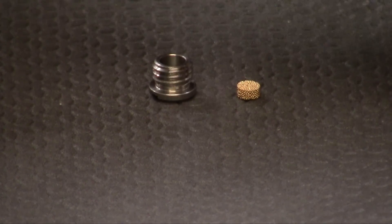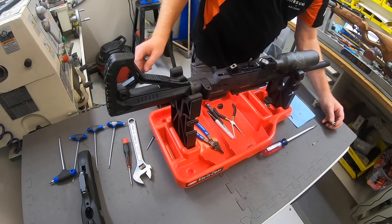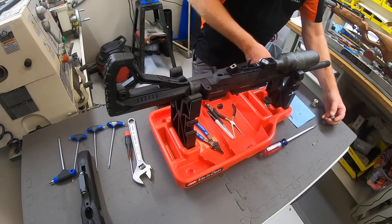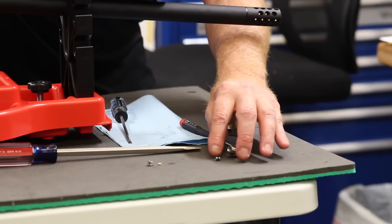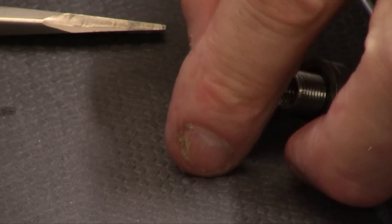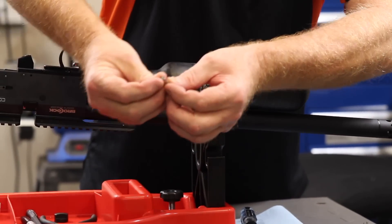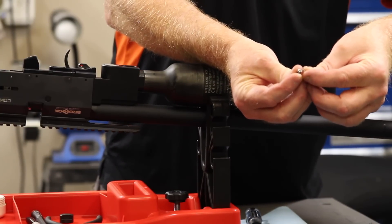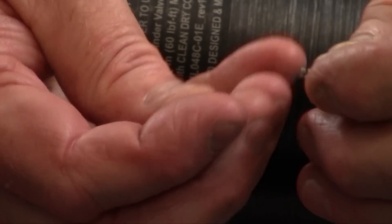There's also a spring that goes against the filter. If we take a small 1.5mm Allen wrench, it can go in and push to remove the little piston — that's the little piston that has the O-ring on it. The spring sets inside a little cup area on one side; the other side is just flat. They've designed it so when the spring goes in, it sets solid and can't move. So you've got the main piece, the piston, the spring, the filter, and the cap.